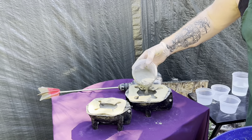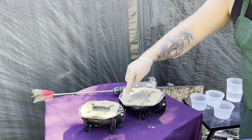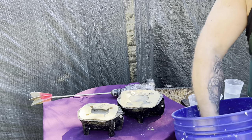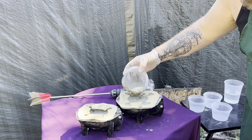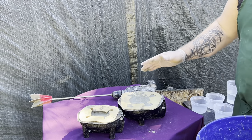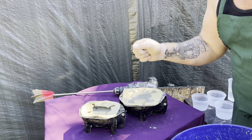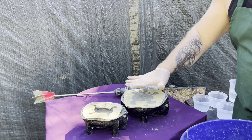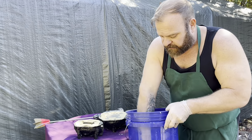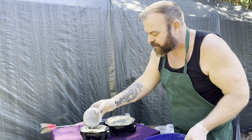Let's top them off. With these turtle figurines, you've got to kind of shake it to get the mix over into the legs. I always at this point put a little extra in the middle because these will settle just a bit. When the water comes to the surface, just tilt the mold to let the excess water run off, give it one tiny little shake to let it settle again, and always have a little extra material to top off if needed. It's a good idea to have one or two little molds on the side so if you have extra material it doesn't go to waste.